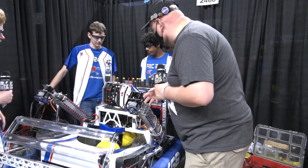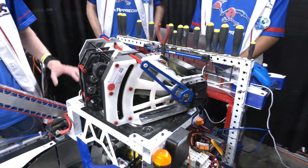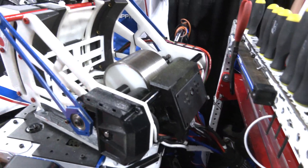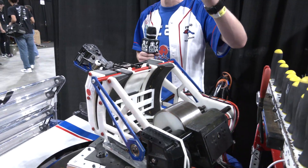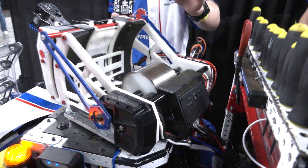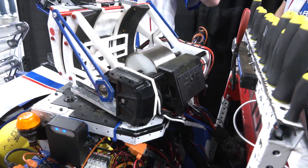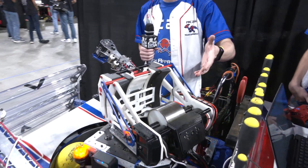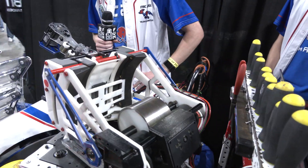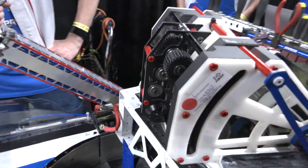Come up into the shooter — looks like a big flywheel. Our shooter is very similar to last year, almost the same. We have a 180-degree turret out the back and a hood that goes up 30 degrees, so we get a nice adjustable shot. Our flywheel is actually a steel ring placed on an HTP hub — it's a three-pound flywheel with all the mass on the outside. We tested a lot of wheels like Fairlane wheels and were getting them up to high RPM and they'd sort of tear apart. So we went for steel. We found out that the steel actually grips the balls really well, and it gets your compression more consistent because a Fairlane wheel expands a little as it goes through, and the steel doesn't.